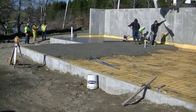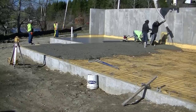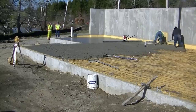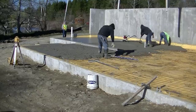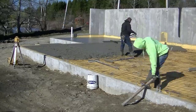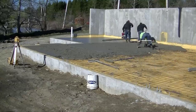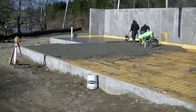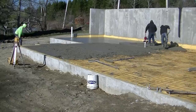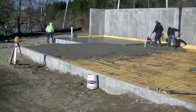We'll get the first truck poured out, get it screeded — that's normally what we do. We dump out one truck, get that truck screeded, then move on to the second truck. It was a little chilly out this morning — you can see we all got our hoods up. It was about 40 degrees, so we're still fighting the weather up here in Maine. It just doesn't seem to want to warm up too fast. Usually it's in the 60s this time of year.